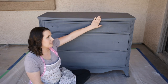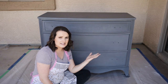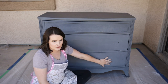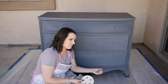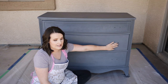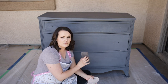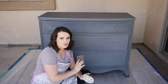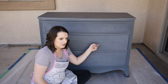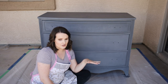I'm going to start with the edges of the piece, starting at the top and working my way down. It is not likely that a naturally worn, vintage piece of furniture would distress on the flat surfaces — that is where it starts looking overly distressed very quickly. I typically stay away from distressing on flat surfaces entirely. If anything, I'll use a very light hand to smooth areas that are bumpy or rough, but I do not distress the paint away to reveal the wood on flat surfaces. I stick to the edges, and that is my general rule of thumb.